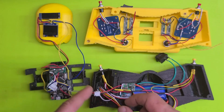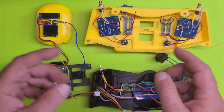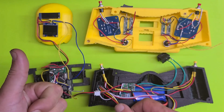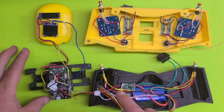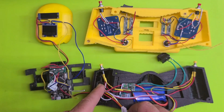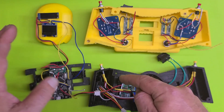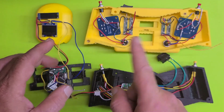Interestingly enough, they can interfere with your home wireless network or even microwaves. My struggle with this turned out to be that one of the problems was I was playing around with a couple of new wireless access points, and yes, one of them was interfering with it. They give you 124 channels to choose from, and apparently the lower band is pretty much used up, so I just put it at 124 and they work great.